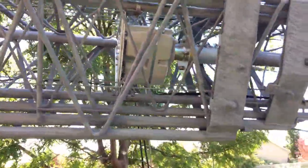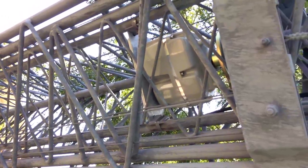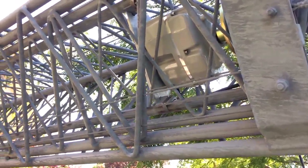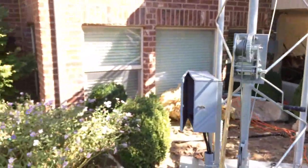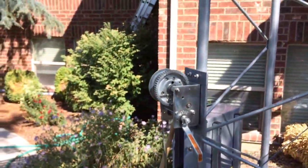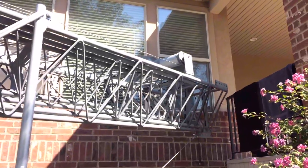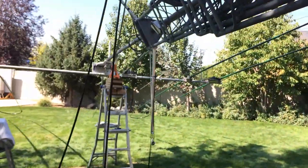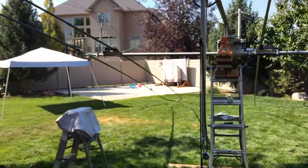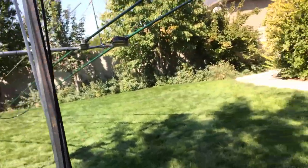Another thing I haven't really ever videoed is the Orion OR-2800 rotator. It fits in this tower nice on the factory plate. The tilt-over mechanism was brand new — I picked that up when I was in Visalia earlier this year, but the tower is used and it has the factory positive pull-down up there. Another nice little goodie is the antenna standoff from KF7P — he does a dual pulley design, which is really nice.